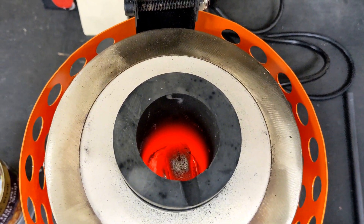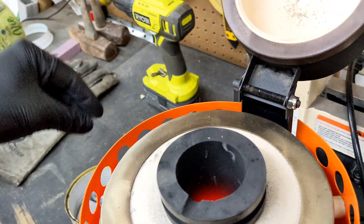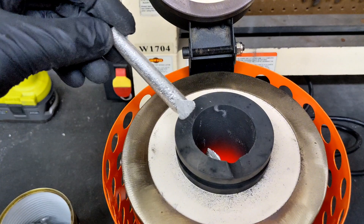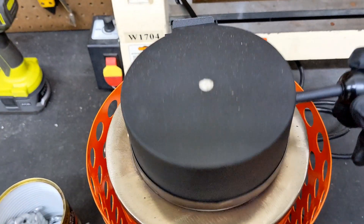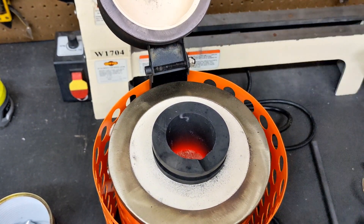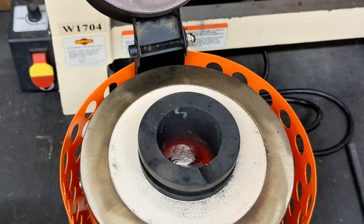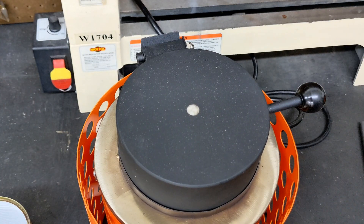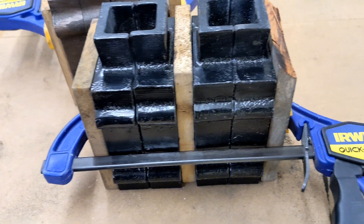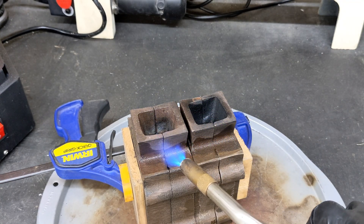While the aluminum is cooking, I'm actually putting together three more casting flasks. Checking back on the furnace — as the metal is melting, I am adding more aluminum to the crucible. It looks like my crucible is almost full and I'm going to add one more piece to top it off. This should give me enough aluminum to cast two of my casting flasks, and I actually have four of them, so after this first one I'm going to pour another set of two.